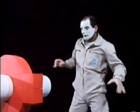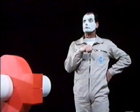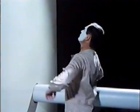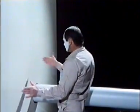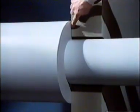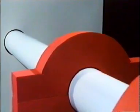But now the shaft will no longer turn. Rotation and sealing. Can they ever be compatible? Here, the shaft requires clearance so that it can rotate. Seal faces not parallel with, but rather perpendicular to the axis. That's the answer. The housing and the shaft boss form the seal faces. Good support is essential for the proper performance of the seal.